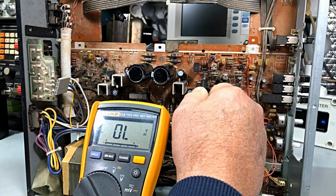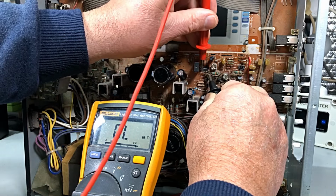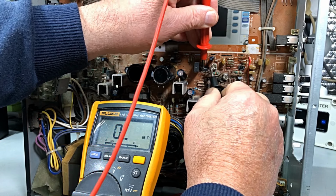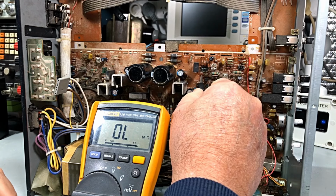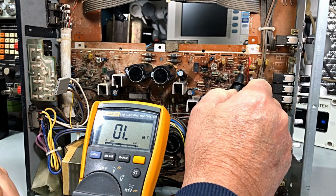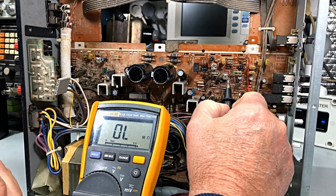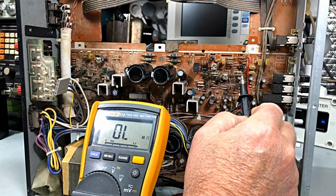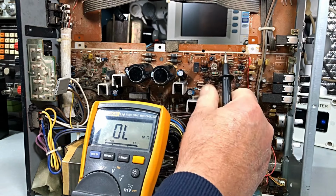it's a matter of resistors. That fella there, he's one of the main sus-looking ones, and he reads 1K and 970 ohm, and it is a 970 ohm resistor. So he's R455, and the equivalent on this side, yeah, we can't follow. I'm wasting time. I'm not following these without the circuit, so we'll get the circuit. But all that is, it all looks pretty straightforward.